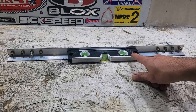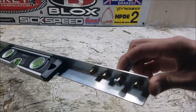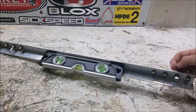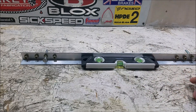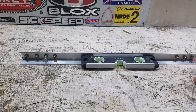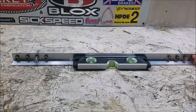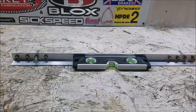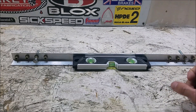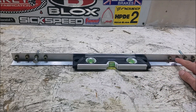I picked up this regular Husky brand level. All this is is a piece of aluminum angle iron — one inch by one inch angle — and I've got holes drilled in it for different wheel sizes. The smallest two are 15 inches apart and the widest two are 20 inches apart. You can adjust in between them by half-inch increments. Even though the E39 had 17-inch rims, I put the two bolts 17 and a half inches apart because that's what fit on the face of the wheel cleanly.